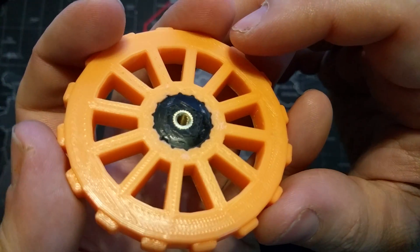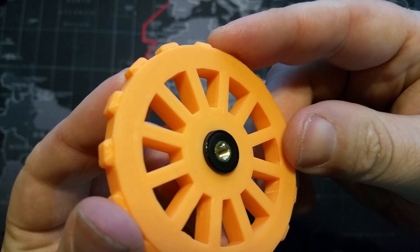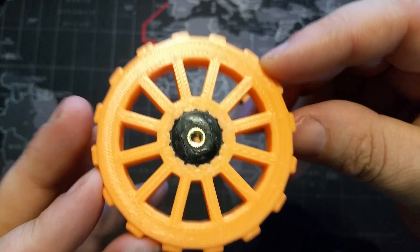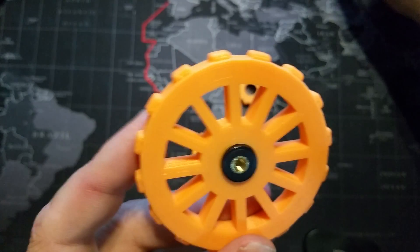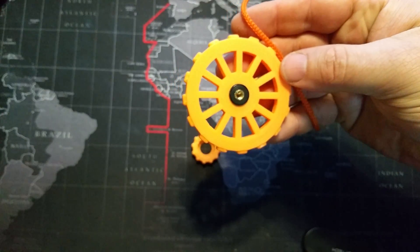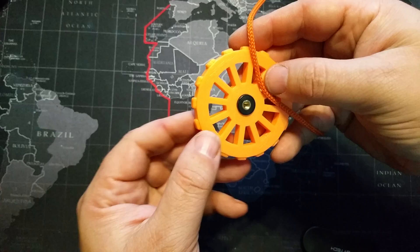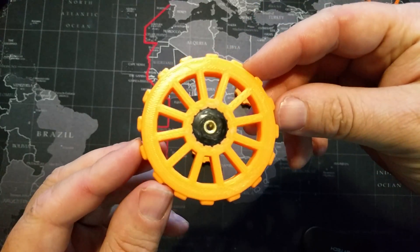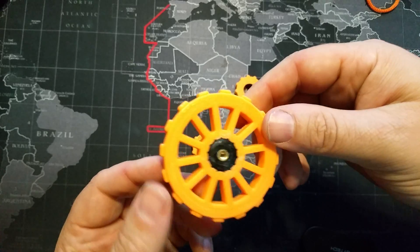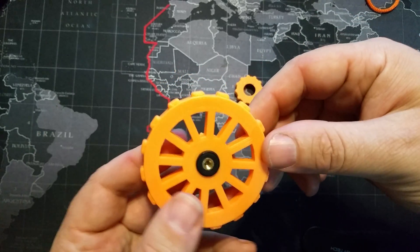Here again we have a close-up. You can see how nice the part came out — that's the top layers, and the bottom layers. This is printed in eSun PLA Pro. It's a slightly peachy but reasonably bright orange. The color looks very different in the video, but it's pretty close in real life. I wonder if there's some IR involved — it looks more pale in the video. But this is their PLA Pro, very, very strong. I kind of went overkill on the infill — this thing is actually pretty heavy. I think I did like 25% infill, it did not need that much, and I did three perimeters. But I like a nice durable part, so I don't mind that.